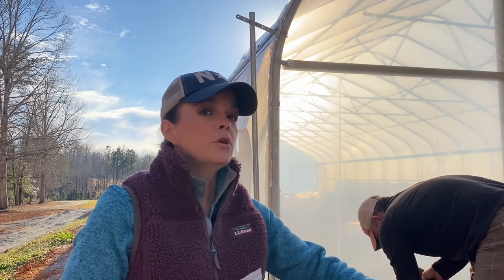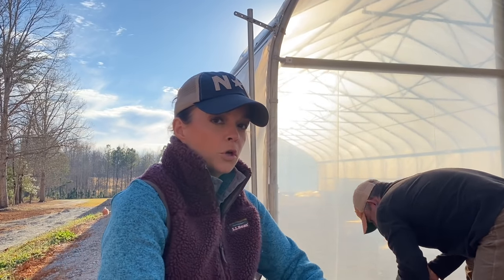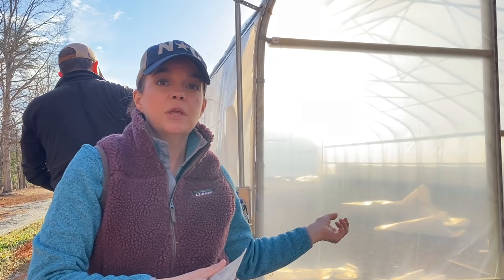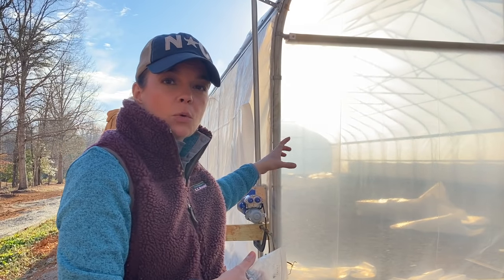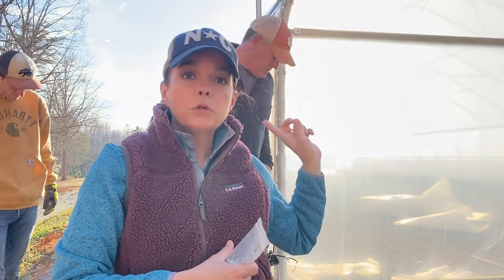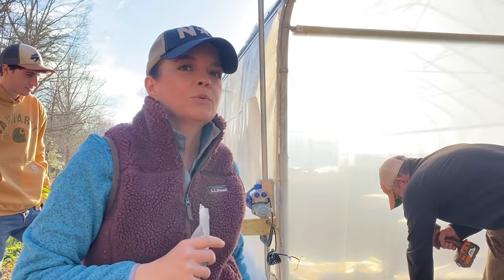Screwed to the curtain from the inside, we can now go take the clamps off of the outside because those were just a temporary hold. So those are going to come off. Then we're going to have to pull the whole curtain and the pipe out of the motor because we still have to put some clamps on the fabric to the pipe right here beside the motor. In order to do that, you have to pull it away, because remember, the corners have that double layer of polyplastic. So that's what we're going to do now.